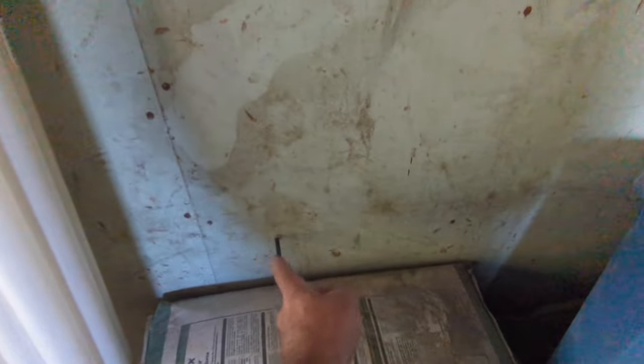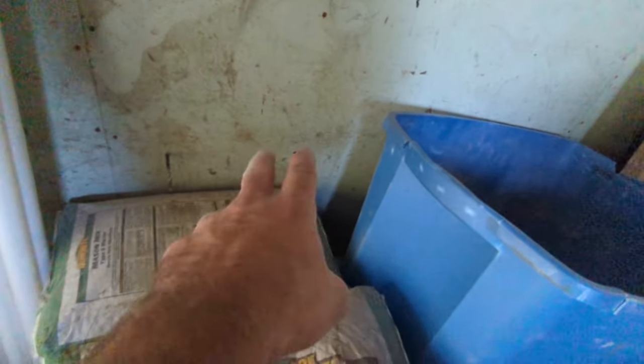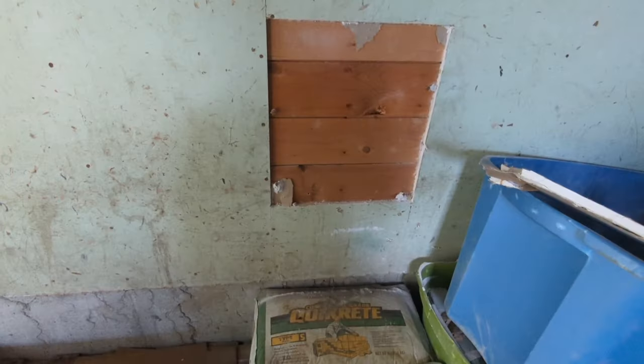I don't know if there's any harm. So I'll probably go right along here to where it's the same distance from there. No, I'm sorry. I'm gonna assume that this seam is really close to the center of the stud and pull 16 inches, and that'll be where the vertical should be. And we'll go up plenty high enough to see both elbows and right along underneath this thing by about the thickness of the sole plate, so when I go to put the bottom edge back in, I can get a hold of something. I'll dump a bunch of mortar down all over my shoe to make sure that's taken care of, and then we can get in there and work.